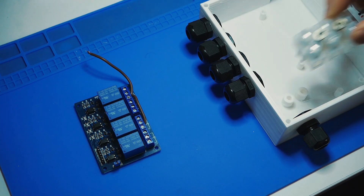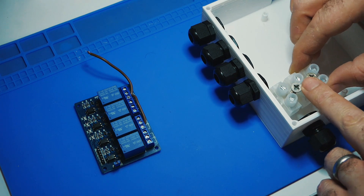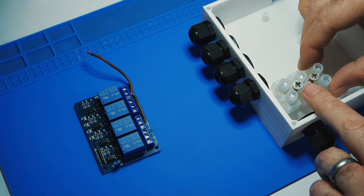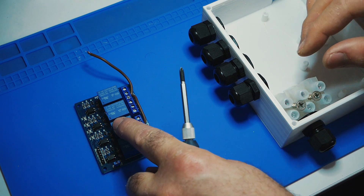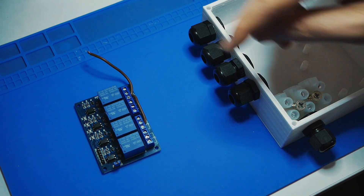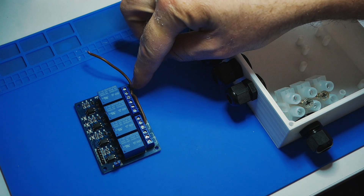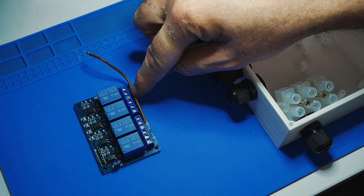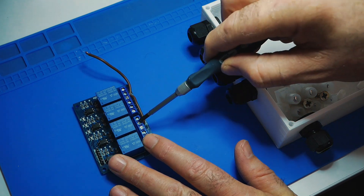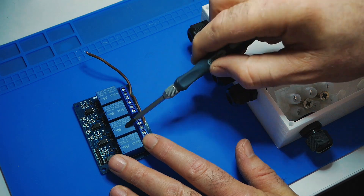The power is going to be coming in through this hole over here and it's going to be wiring up to this, which I'll then be connecting live, ground, and neutral. This here is going to be putting out mains voltage through these relays, so it's going to output the live into the center pin which is the source, and I've just connected that up to that pin as well. We're going to be using these two relays to power our two fans.